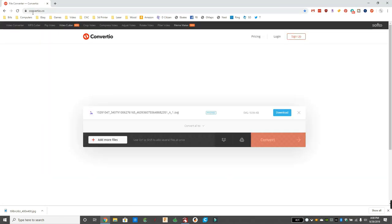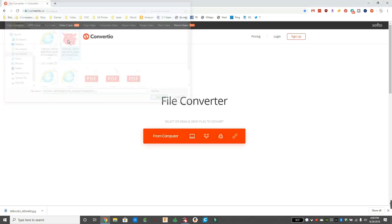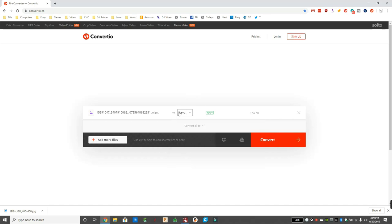But we found this cool website called convertio.co. I'll leave a link in the description below. What this does is you upload any file, like we're going to upload this JPEG file, and then we select what we want to export it as. We have a lot of options, but SVG is typically what we like to use in CNC and lasers. So I click on SVG and then we just hit convert. It uploads the file, converts it online, and then after it's done, it'll give you a download link.